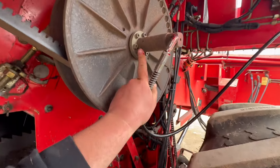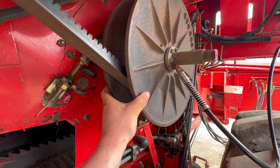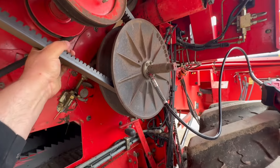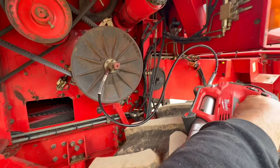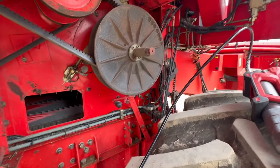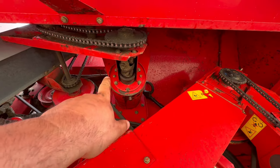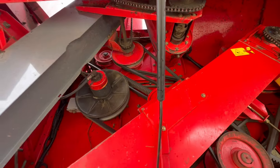Round the other side, you've also got to remember — this one here doesn't actually do much. It's got like a big spring behind there that will open and close, which will change the speed of this drum in here. We only put like two pumps in it per year and that's it, because if we do any more it's over-greasing that one and it'll just feel full of muck. Usually two or three pumps a year, might do it end of season. These joints in here and these chains will want doing — might even take them off and change them for new ones, but that'll be in another video.